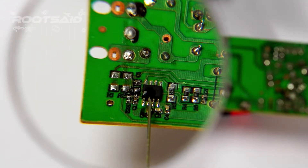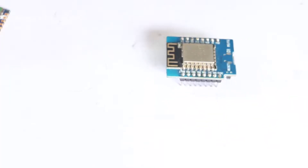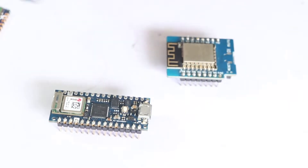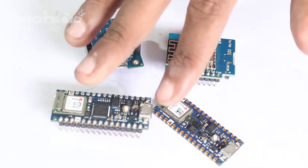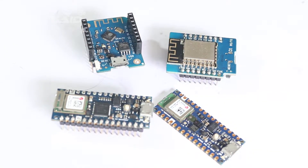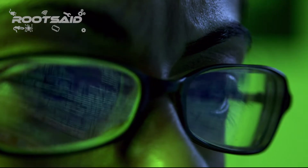Does that mean we can't use our old sensors anymore? Not exactly. Almost all of our microcontrollers work under 3.3V logic these days. Most of these devices that work under 3.3V do not like being provided with 5V and will get burned in seconds.